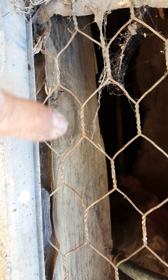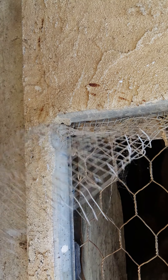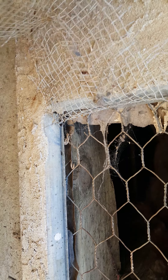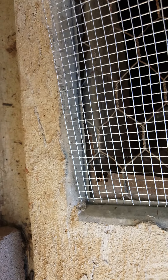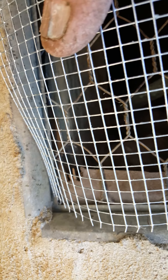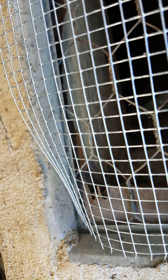You can get a pair of needle nose pliers in the screen area and you can force it up and down and around. It might bend a little, but it'll do it at the top where it's invisible. Here's a piece of screen I have already cut. I'll pull the rest of this out of the way with gloves on of course. Make sure the wire is out of the way. I'll start on one side — you'd want to start at the bottom and the top, get it in the groove, push the back part into the groove.